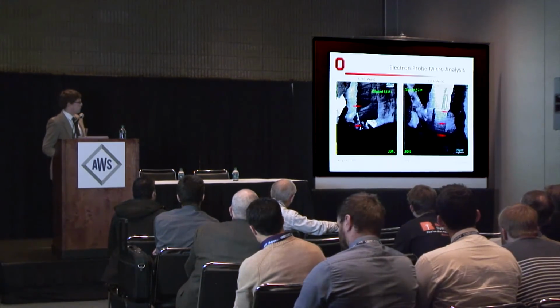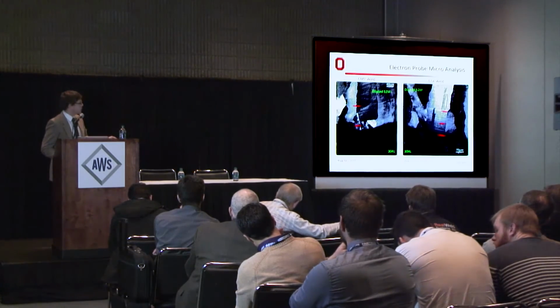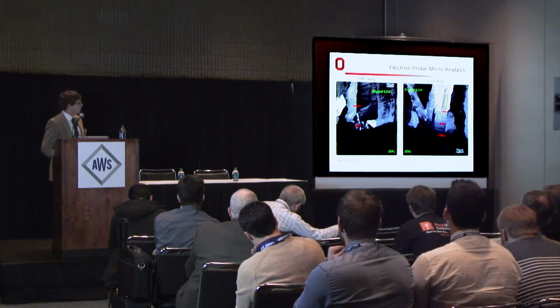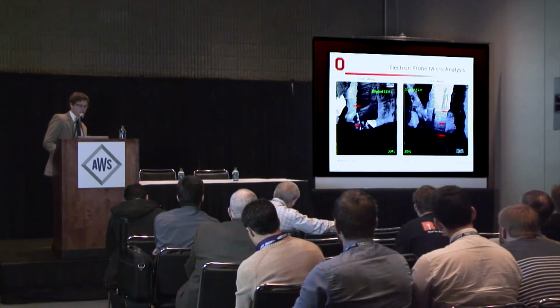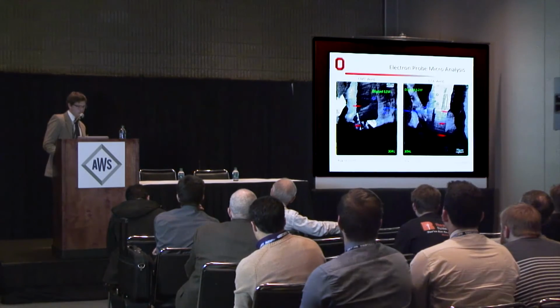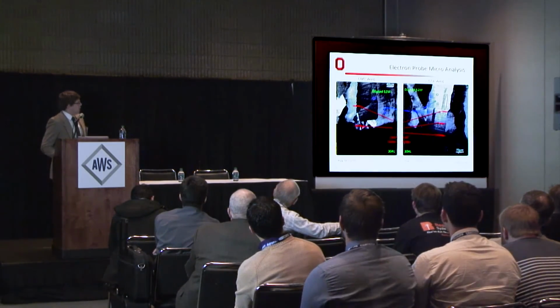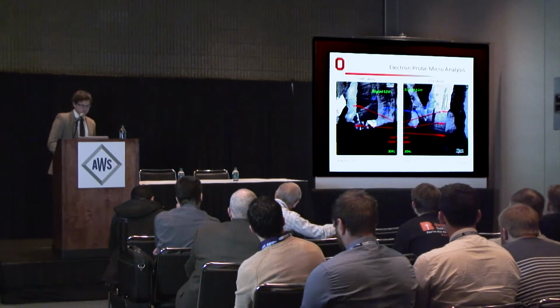From the results in this experiment and previous experience, we know that these white regions that are perpendicular to the fusion boundary are interdendritic niobium carbide matrix eutectic, and the black dots are titanium carbide particles. And the red circles are the locations of the electron probe traverse.